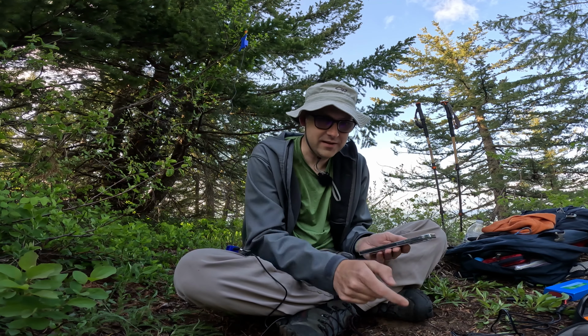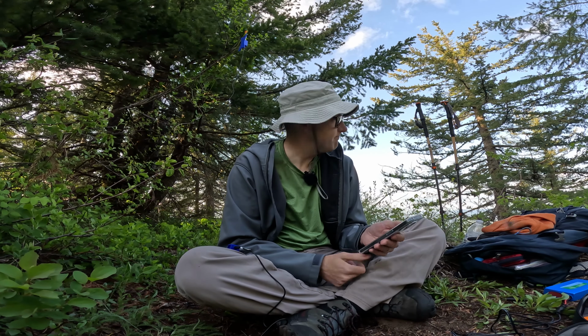Cool. So that was on 20. I think I'm doing better on 20 too, as well. Okay. So that is not a commentary on verticals altogether. This vertical didn't work very well today, but there could be another reason. So I got New York and Utah on 20 meters. So 20 meters is probably opened back up because it's getting later in the day, but also I think this is a better antenna for 20 too, as well.